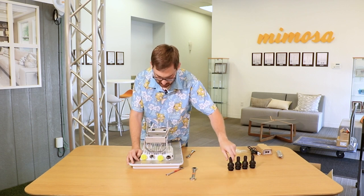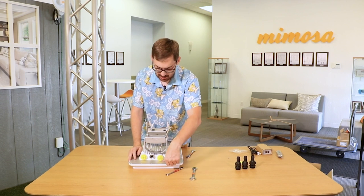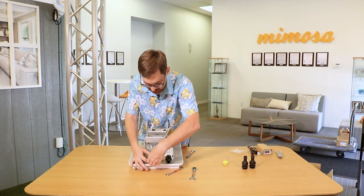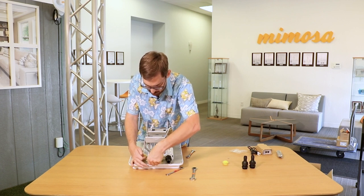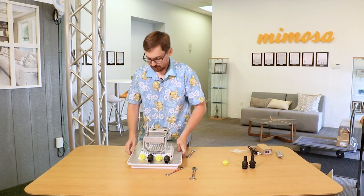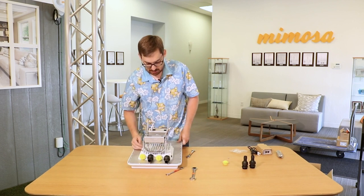The glands are used in case you're running cable to a particular port, whereas the caps are just to cap off the port and keep it from getting any kind of dust or water inside of it. In this particular configuration, we're using PoE power with this port and we're using fiber for the data. This one's the power port for DC, and this is an extra SFP port if you need it.